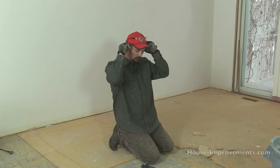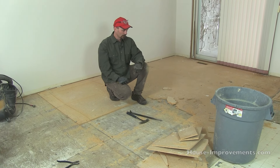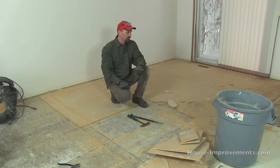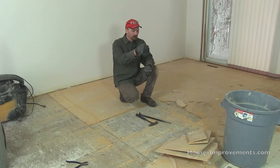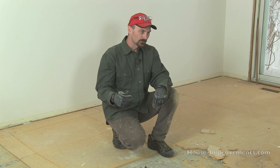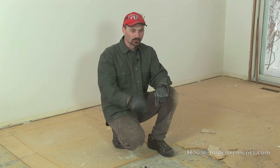Basically that's how I would remove underlayment. And if you had vinyl flooring, you could do the exact same thing — just set the saw and cut right through the vinyl. You could try to peel the vinyl off if it comes off as easy as what we've seen here, but generally it won't come off that quick and easy. If you're around cabinets — since this was usually put down before any cabinets were in the way — you could use a reciprocating saw and cut around the front edge of the kick of the cabinets. They also have those little oscillating saws now, which would work well for that too, so you could cut it free and remove it from the main part of the room.